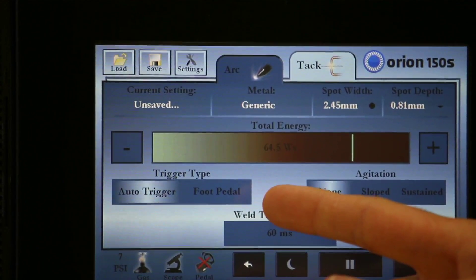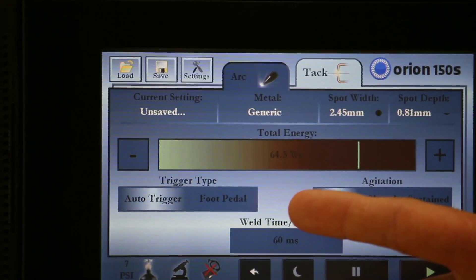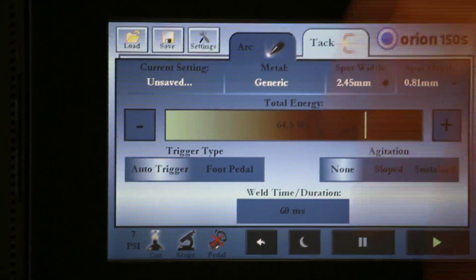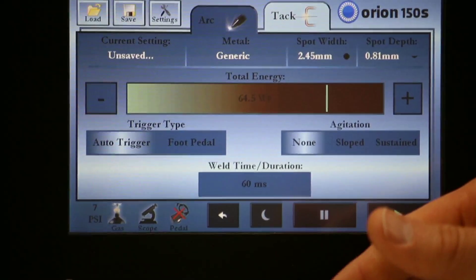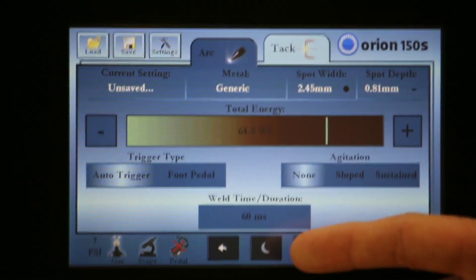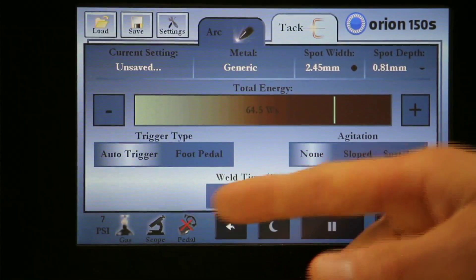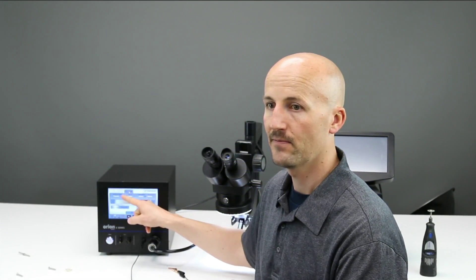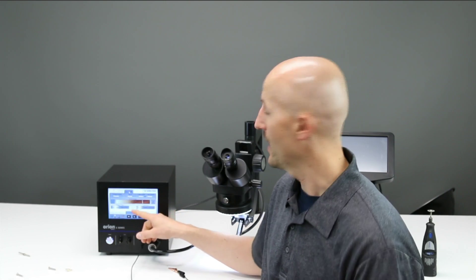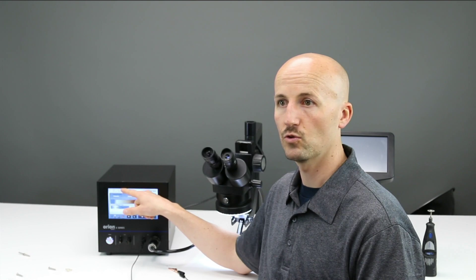If you're welding on any of our older machines — and I've mentioned this for new machines too — if you don't feel like you're getting the results you want, reset to factory default settings and make your adjustments from there. On the older ones, whether a 150S, 250S, 100C, 150i, 200i, or 250i, some screens had a reset button on the front. But depending on your model, you may need to go to your settings tab — it's in the top left or top right, easy to find, says 'Settings' with a picture of some tools.